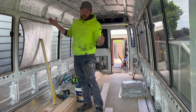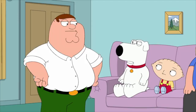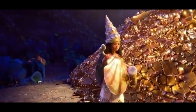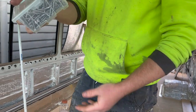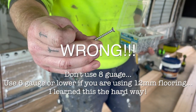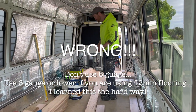I don't have a floor nailer, but I'm going to use the traditional old school method, but I'm not using nails, I'm using screws. That's not a tradition. But it should be probably stronger than using a stapler. What I've got is these screws here, which are decking screws. And they are 8 gauge by 40 mil. And they'll be going in on an angle into the tongue. And it should hold it nice and tightly without going through the flooring, which is great.